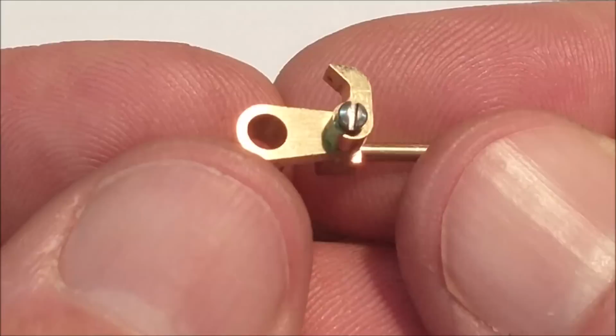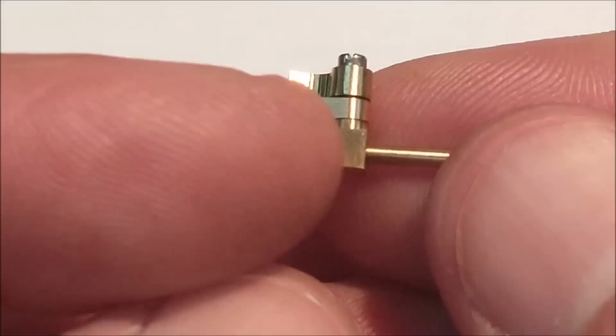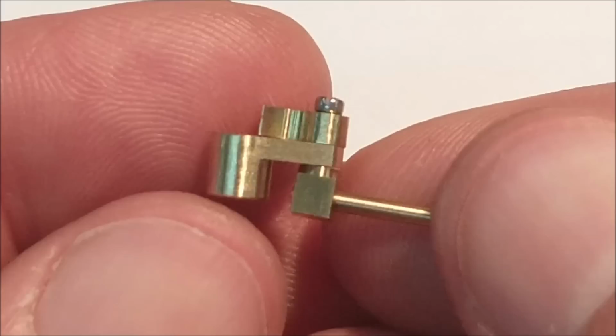Those holes where this screw goes through are going to be opened up to about 2.75 millimeters, 2¾ millimeters. How's that? Staying consistent. I'm going to open it up so that the shaft of the new part here will pass through, and these will have a positive surface to locate on. It'll only take a couple minutes, and I'll show you how I'm going to locate those features. They're kind of small, and I got a trick up my sleeve for that. It might make your life a little easier. So when I get to that, I'll film it.